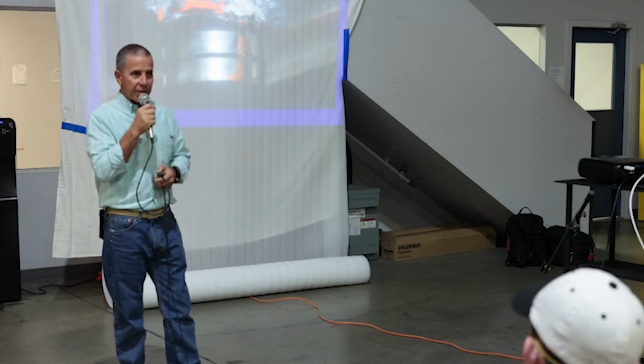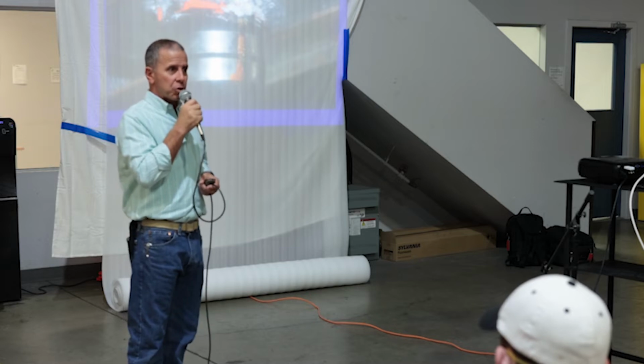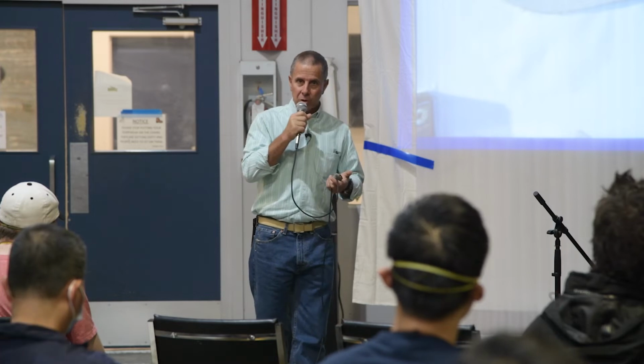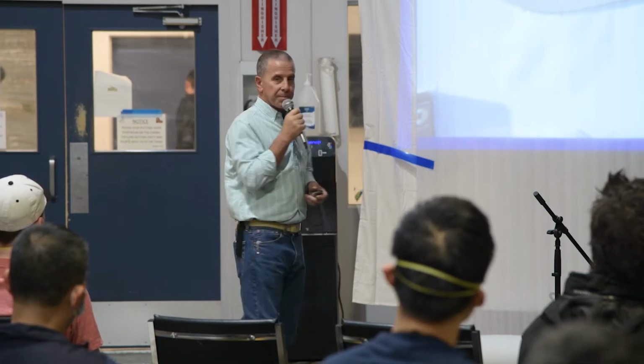This can even happen at plumbing fittings. So if you have a rubber hose, for instance, that's pushed up against an aluminum structure, or even laying against an aluminum structure, that once again traps water against the aluminum, then poultice corrosion can be the result. Structures that require cutouts or holes in the aluminum, any place that cutout exposes raw aluminum and paint that is not fully sealed or bedded in some way, the likelihood of water getting beneath or between those two is pretty high, and the result is a blister that forms adjacent to the hardware.